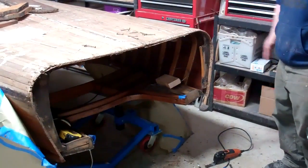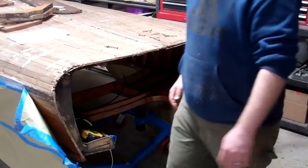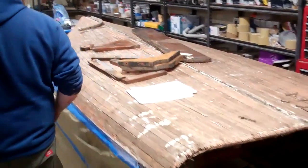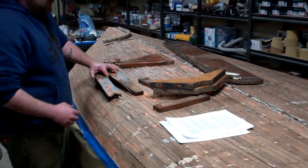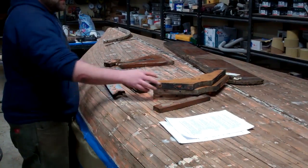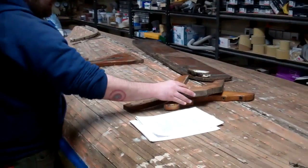And the interior frame members that rotted so badly, yes, that you'll replace and install after you've got the transom in place? These are all going to be replaced, all the mid frames, and a lot of the supports on it too. Luckily these frames we're going to be able to save. There's not very much rot on those at all.